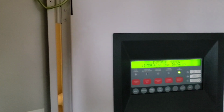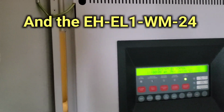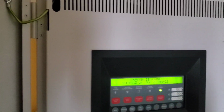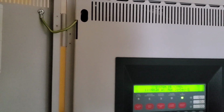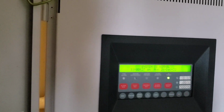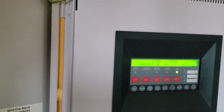And what happened earlier was when I was testing the system, making sure everything was correct, the TrueAlert and the 9840 silenced. But since obviously the system sensor devices aren't compatible with Smart Sync, they kept on going off. So I have that Smart Sync module. I just have it tied to the visual NAC, and I just have the visual NAC set to turn off when I press alarm silence. So there won't be any audible silence during this test.